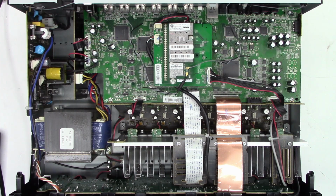They're all working great. So I've taken the unit, I've flexed it, I've moved it around, I've bumped it, dropped it. I can't get the audio to cut out. So hopefully just a simple shot of Deoxit took care of this unit, as well as tightening the ground screws.